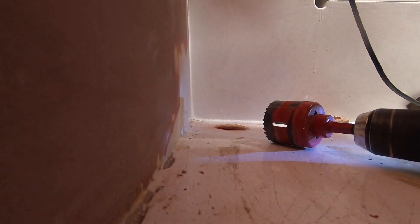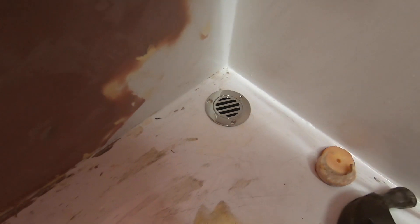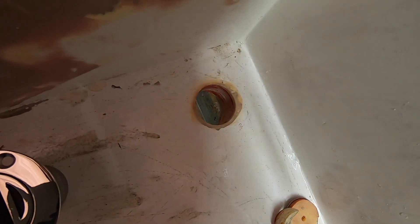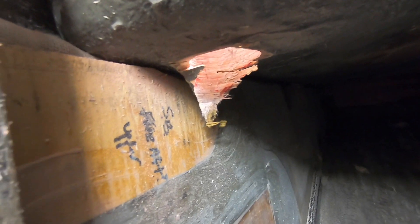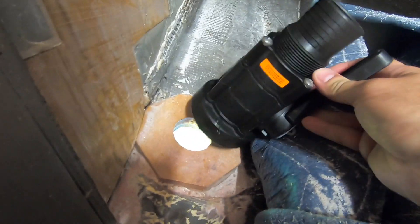There it goes. The new drain goes in the corner here. I still need to clean out underneath so I have enough room to put a two-inch pipe on that. That looks good — you can see why I wasn't able to get through the last part: the metal pipe was in the way and my oscillating tool wasn't getting it. I should be able to clean that out pretty easily. And here's what the through hull is going to look like — it's just this much of a curve.